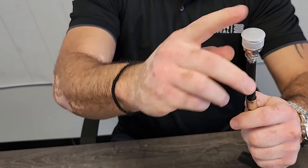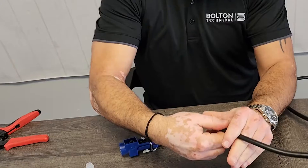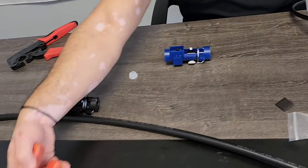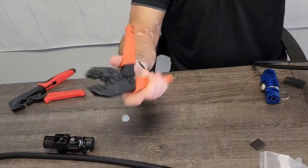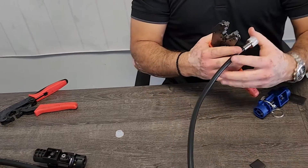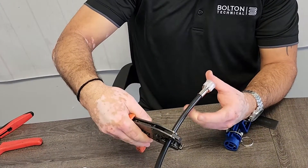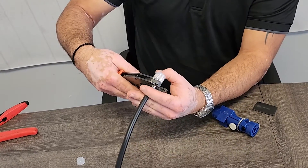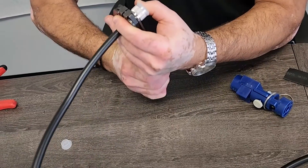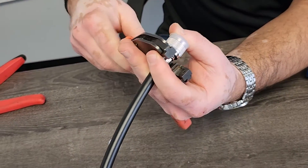Apply your sleeve first like so, then the last step is the connector that goes over the pin. Press down like so and it's ready. Bring your sleeve all the way up — sometimes it might give you a little fight but it's just a snug fit — like so. Then here's the LMR 400 crimper, and it's going to do the same process of termination. Snap it to release, put it over your cable, slide it all the way up, and hold the center conductor and connector in place.